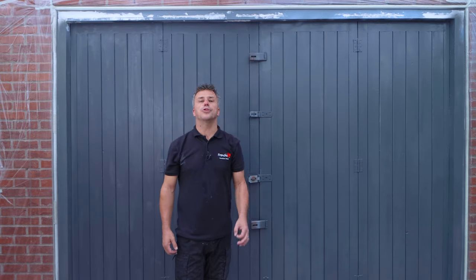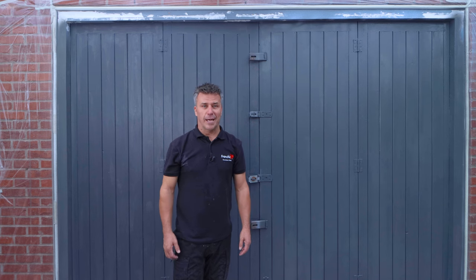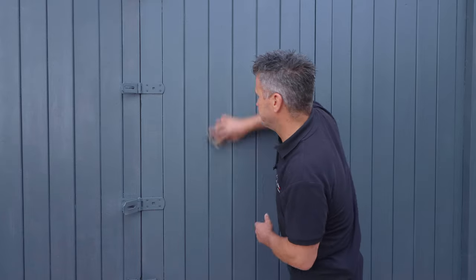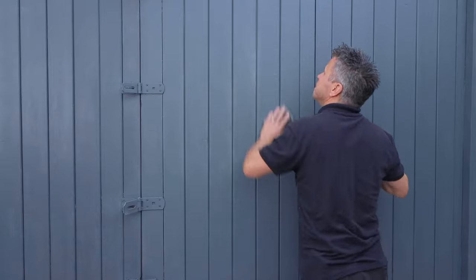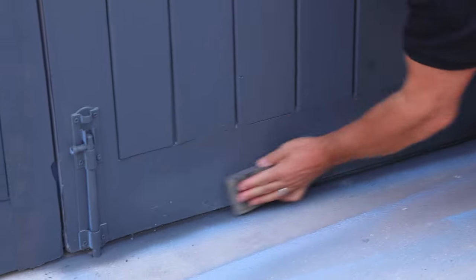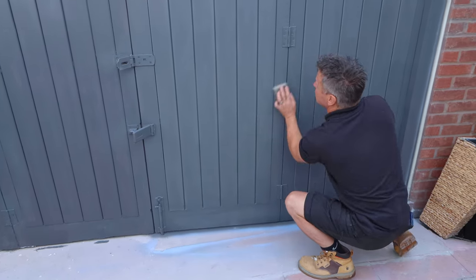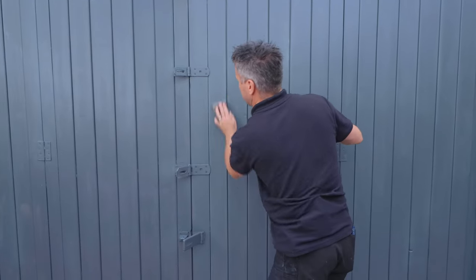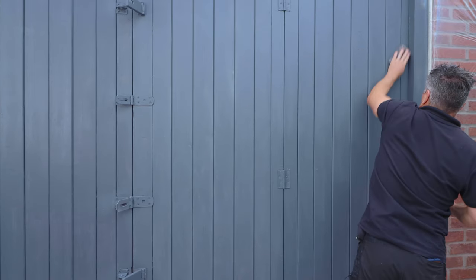So that's the three different options you have for applying your paint. Once this first coat dries, after about two hours, I'll apply a second coat. Now the first coat of paint is dry, I'm going to give it a gentle sanding with a sanding sponge before applying the second coat. When using Alfresco paint, you wouldn't normally need to sand between coats because each layer bonds with the one below. However, when painting outside, molecules floating in the air can potentially stick to the surface of your wet paint, so a very light sanding sponge helps remove these in preparation for your second coat.